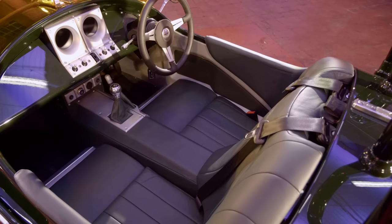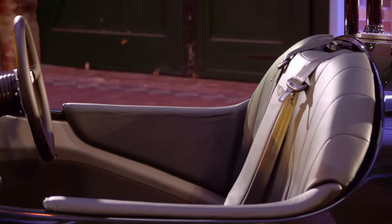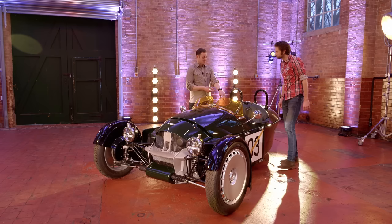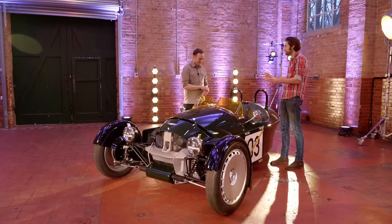All these metal aluminium sides are the chassis — Morgan's first ever monocoque — and that's for quite a good reason. There's no waste; all the structure is what you actually see, no B-panels and over-trimmings just for aesthetics. We've made the structure the visual element of the car. The floor pan area in the middle is sheet and fold laser-cut aluminium — familiar technology to us — and can be recalibrated in future quite easily. For example, if you wanted to change the drivetrain, you could do that. Under one side is our fuel tank; under the other is a void, a convenient storage space, but also leaving opportunity for the future.